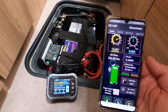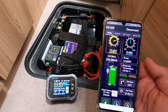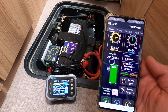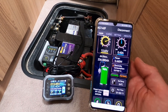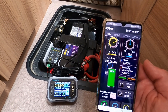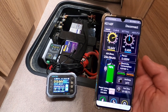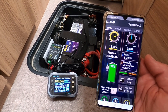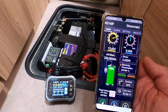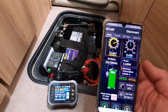I'm not sure if having an undersized shunt could blow things, but I'd say it probably becomes inaccurate because it can't accurately measure the discharge when undersized relative to the draw — but if anybody knows the answer to that, drop a comment below. I hope you found this review useful and that it gives you a good insight into how to install a battery monitoring system. This particular product I definitely recommend — the price is absolutely right and it's definitely something you could install yourself without any problems.